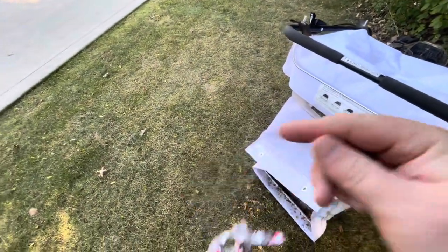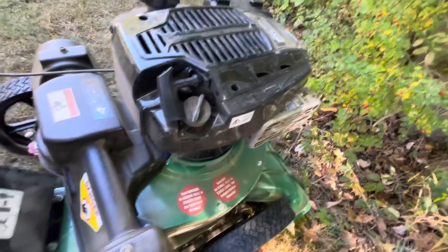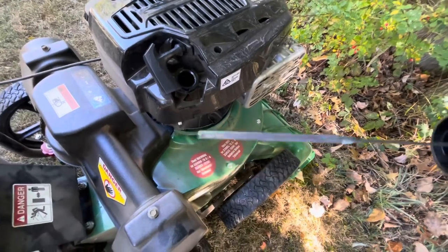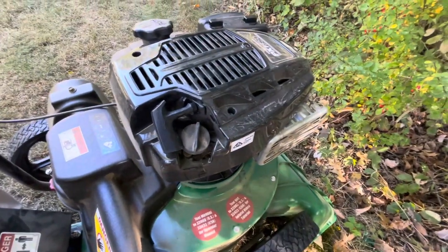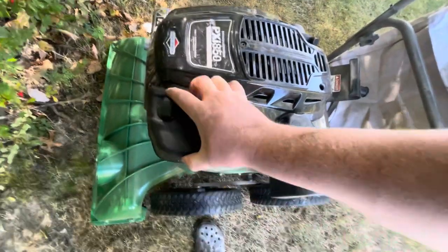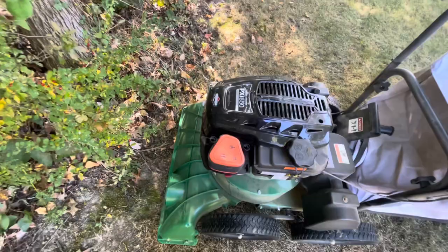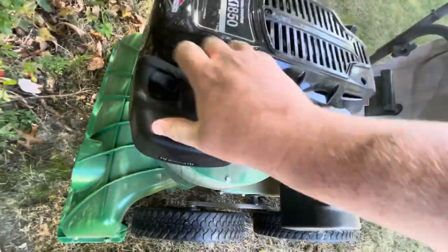This is honestly impressive. The thing I forgot to show you: in order to drain the oil — this thing does have a dipstick on it. Everything looks normal there. This is not a fill-and-spill; it's just got a dipstick, so I think in order to drain the oil you have to turn the machine over on its side. One other thing: this air filter — the machine's brand new — all you need to do is turn these couple of locks and it pops off. It looks a little dirty, but I haven't really used it much. In order to put it back on, keep these two knobs with the lid; if you lose them it might pop off on its own. Just turn the two locks back and it's in place.